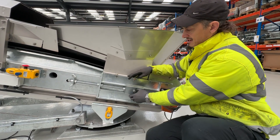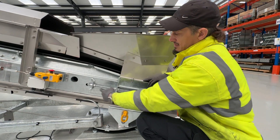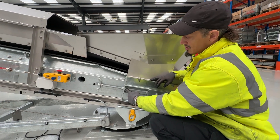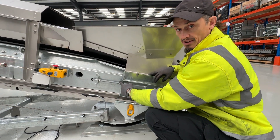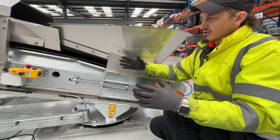With this slackened, that's good enough. Then we can move on to these two bolts in the middle — we don't want to touch the bolts at either end. We loosen off this back nut, which is just a lock nut — wind that down the thread — and then we use this nut at the front, which will tighten to pull the drum in the tail of the conveyor left and right to move the belt.